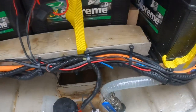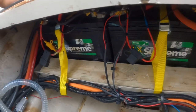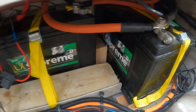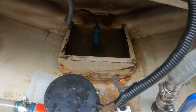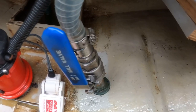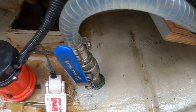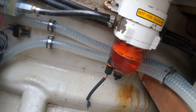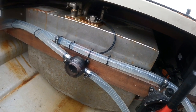We've got three heavy duty batteries — one for the engine start and two linked in parallel for everything else. That's the transducer down there for the echo sounder. This is the seacock and skin fitting for seawater in, for the deck wash pump. There's a fuel filter and a custom 300-litre stainless steel fuel tank.